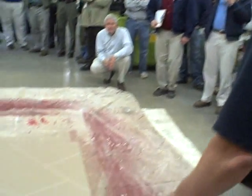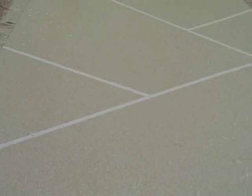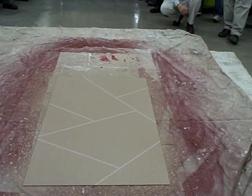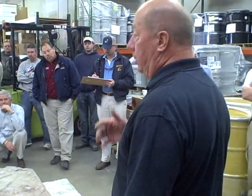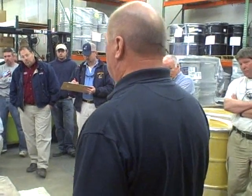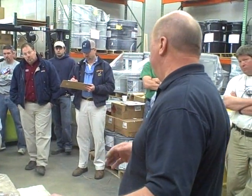We sell a lot of this product because of the non-slip texture for stairs and stairwells — like condos and things like that. Because even older people are trying to stay healthy today, the first three floors you'll want to put a clear sealer. After that, you probably don't need it because it's not getting heavy use. If it's about saving money, you can tell them to put a sealer on the first three floors and skip it above — that shows you care and you're helping them save money.